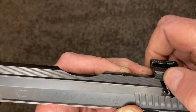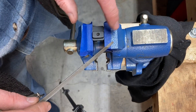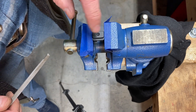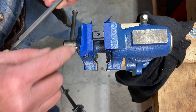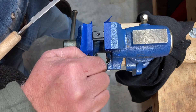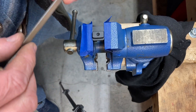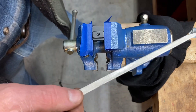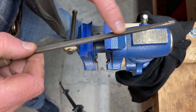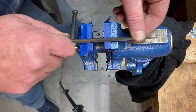So I spoke to the owner — going to take material off the bottom of the sight and then install it. Got the sight in a smooth-jaw vise with some painter's tape to protect the sight. I want to take down that surface. I don't want to change the shape of the V. So I've got a little triangular file where I've taken down one side, so when I've got that against the surface I don't want to file, I'm only going down.